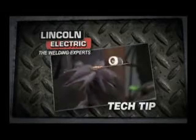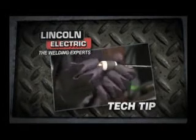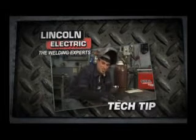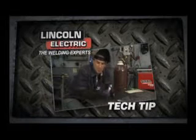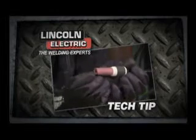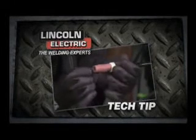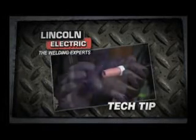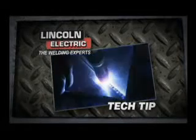This is your tungsten — electricity is gonna go through, melt the metal, and then you're gonna dip in your rod. Get your cup, which has the shielding gas; for this we're gonna be using argon. Put the cup out to a distance that you like. I use something like that if I'm doing an inside corner, but you'll go shorter for an outside corner, because what you're trying to do is keep that shielding gas around the steel or aluminum to keep it from oxidizing.